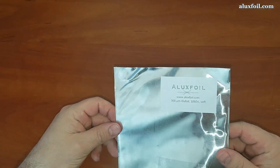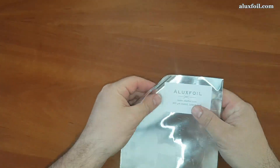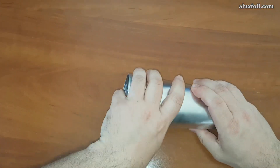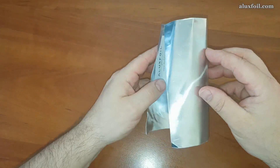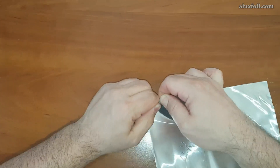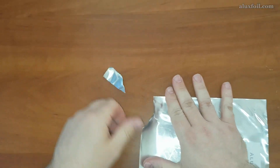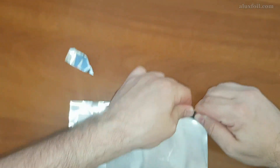At the end, this is 300 micron aluminum foil. This is actually no longer a foil since the foil thickness is up to 200 microns — beyond this thickness it is called aluminum strip. You can form it easily; it holds the form but you can reshape it again. You can cut it with scissors but it's very, very difficult. You can also tear it if you have strong hands and a bit of luck, but my second try wasn't successful.